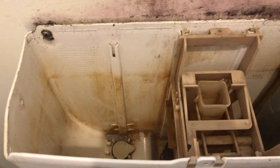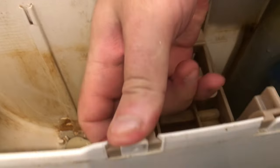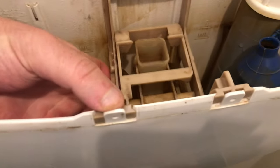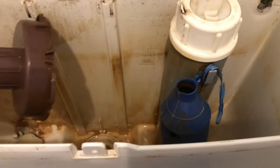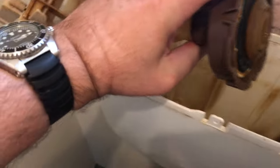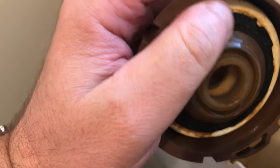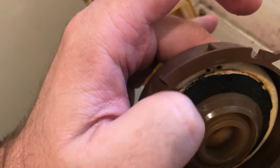So how do you get to that? There are clips here — bend the clip forward a little bit and then lift up from underneath. Let's take the whole mechanism up and out. There's a rubber washer — the rubber washer here is really perished. You can see it's all perished and just falling apart. That's what's leaking the water into the bowl.